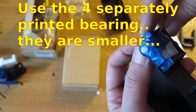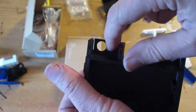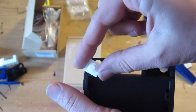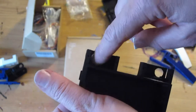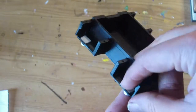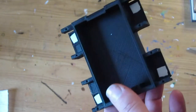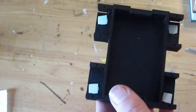This bearing here is too thick to fit down inside where it's supposed to, and it makes it sit up too high — making it almost impossible to stick the leg over the servo without bending and possibly breaking it. So I'm going to have to shave this bearing thing down. See, the square is only about that big, but the base plate that's printed on is much bigger. I'll have to shave it down so it fits inside this little square recess. Now they're all four cut down and fit flush — they don't stick up above.